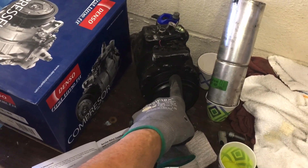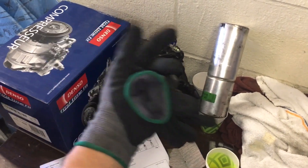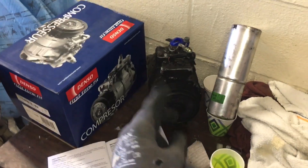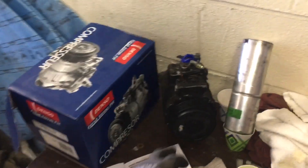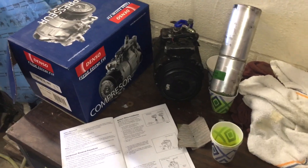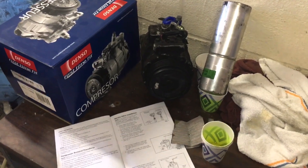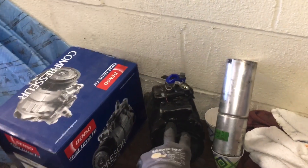Because if you're replacing a burnt-up compressor, of course you're going to change the expansion valve, flush the evaporator, flush all the parts, change the condenser if needed, and the receiver dryer. I say 'if needed' because way back before parallel flow condensers with microchannel, you had big three-eighths tubes that were easy to flush — but that's ancient history. Now, when you're going to do your compressor removal procedures, you have to perform an oil balance.